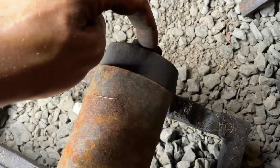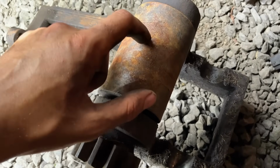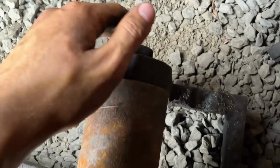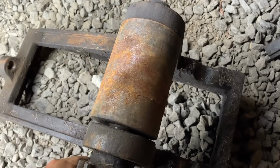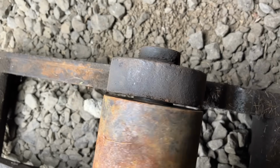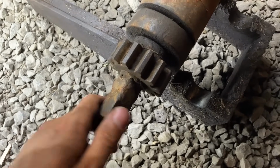And based on this cotter pin here, I thought there'd just be maybe a key sitting in this and a keyway in the shaft or something. I should have known, there's nothing there. But there isn't that. And the same thing on this side. I put the dental pick around, and there's no obvious marking of how this is indexed to this roller, because you do supply power to this roll.